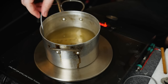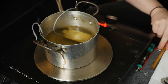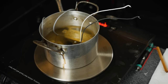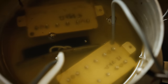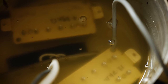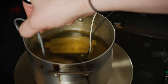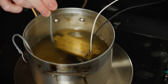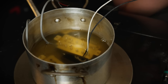After a pickup has been fully wound, it's a very good idea to submerge the whole thing in a bath of liquid wax. I'm using a blend of paraffin and beeswax for my potting material. Submerging the pickups until all the bubbles cease rising ensures that the liquid wax permeates all available gaps and airspace left in the pickup. When the pickup is removed and left to cool, the wax will solidify inside, consolidating all of the internal parts and preventing any loose coils, spacers or covers from flexing, rattling or moving independently from the whole unit. Parts moving and vibrating independently will generate unwanted noise and cause feedback which is impossible to tame. These microphonic effects are undesirable — pickup manufacturers only didn't pot pickups at the beginning because they overlooked the fact, not as a stylistic choice. They cut corners, the pickups were noisy, then they started potting the coils. Simple as that.